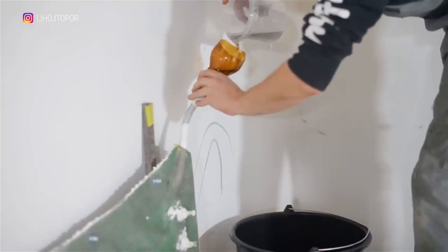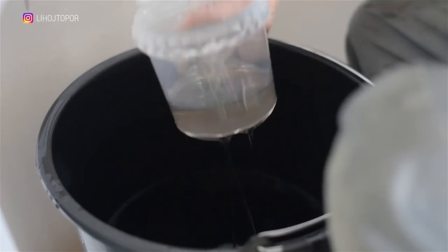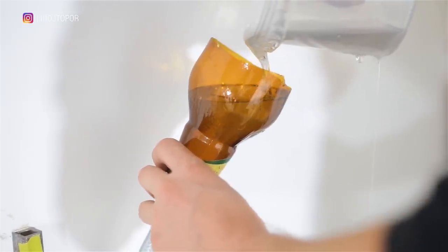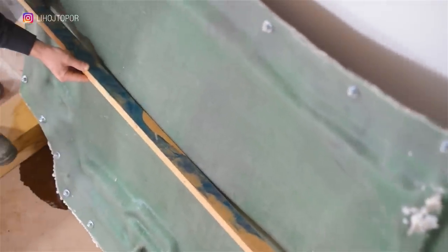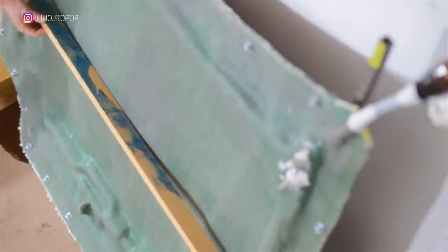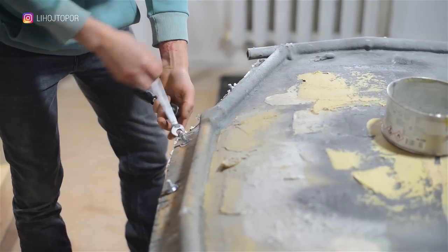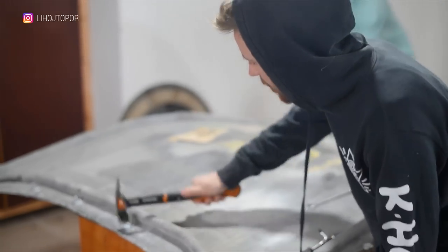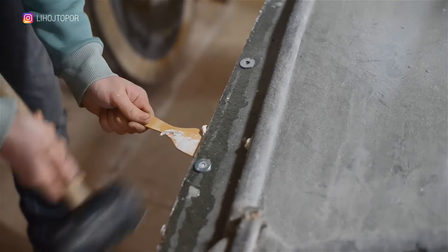The filling process eventually took more than five hours. For the future, the holes just need to be made larger. Hour after hour, liter by liter — it was already 2am, and I realized I had already filled in more than 20 liters of resin, and the hood was not even half full. The worst thing was that I ran out of this compound, and another compound cannot be poured until this one begins to set. Also, the second part of the matrix, which gives shape to the lower part of the hood, swelled and formed a buildup. Now it's clear it was necessary to make the load-bearing structure outside, but we thought the matrix was solid enough not to deform. I decided to add resin to the bitter end. Two days later when the resin began to set, I added another 25 kilograms — almost 50 liters in total. This hood was no longer suitable as a hood, but it was necessary to fill it to understand all the nuances. So this is a test sample, from which we will know exactly what needs to be improved.